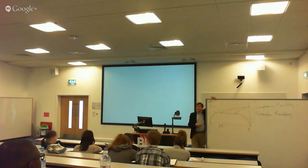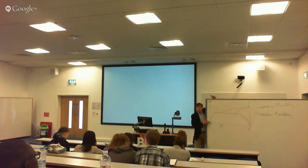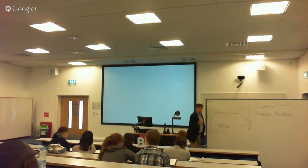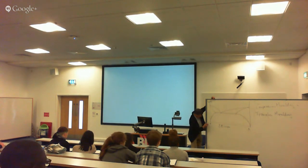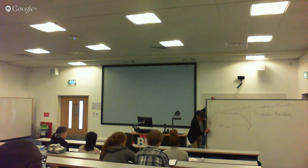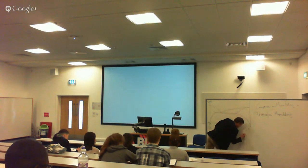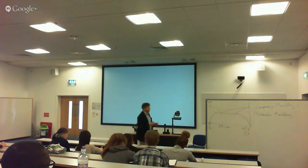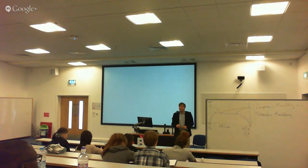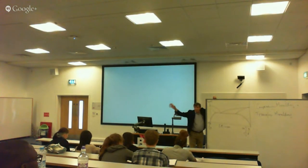And this is for what we call a binary alloy. Binary means two elements. So we have two elements, say metal A and metal B. Please remember how to read this. At this end, we have 100% A, 0% B, pure A. At this end, we have 100% B, 0% A. Anywhere in between, you have a bit of each. Right in the middle, you have 50% A, 50% B, right? There are notes on my BU, but remember, it's very easy.